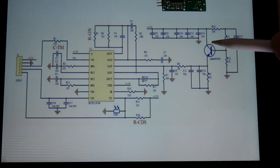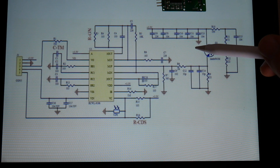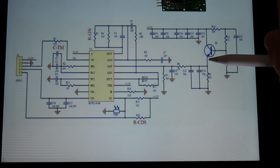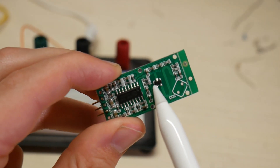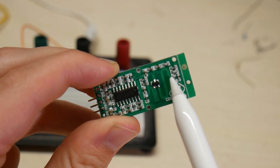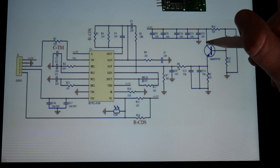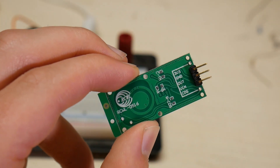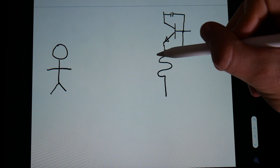This is the schematic of the Doppler effect module. There are lots of videos on YouTube that have done a more in-depth analysis of this circuit, so for now I'm just going to do a simple one. Here is the microwave transistor, which has a few other elements around it. What they don't show you in the circuit is that coming from the emitter of this transistor, there is this squiggle line that forms the antenna and inductor in this circuit — that line is made of a trace on the circuit board. There is also a small bit of capacitance between the collector and base, as well as the emitter and base, and little bits of capacitance throughout the circuit that are very important when operating at such a high frequency.